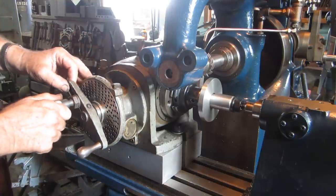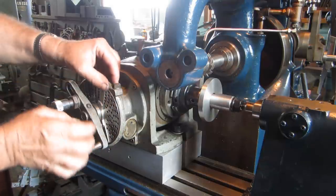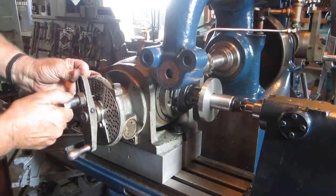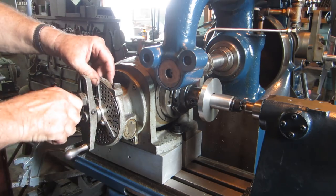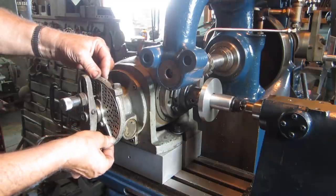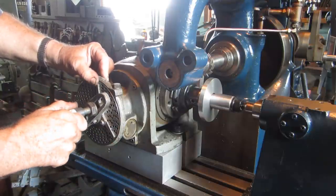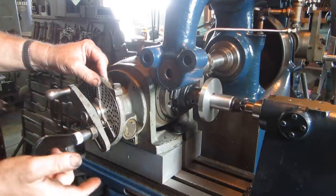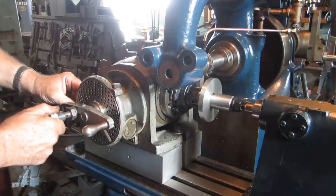So in order to make sure that we only go 15 holes at a time, there's this cool little gauge, and I've already got it set to go 15 holes. If we start, we'll start at the top row. It doesn't really matter, but that's where I'm going to go. This is adjustable, like a little gauge, so that you don't have to count each hole separately. So I have it set for 15 holes, so it's exactly 15 holes from there over to this side of the gauge. And then when you get ready to set the next one, you run this around and you come over here